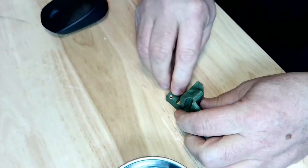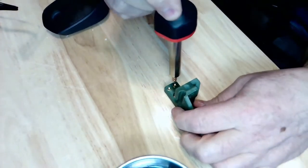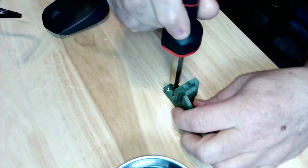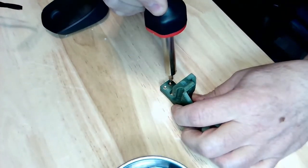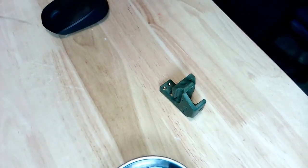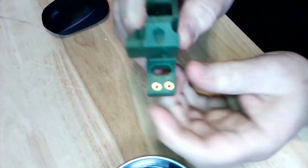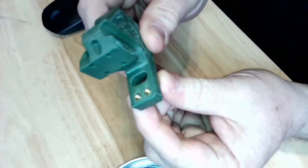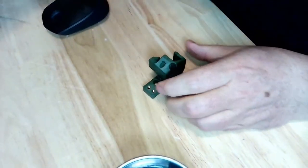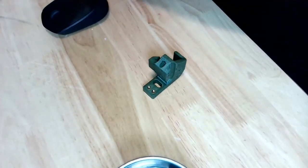Mind you, the iron gets hot. There's no temperature control in this iron. So let's try the second one. Oops, come on. A little more. Oh, there we go. It's a little below flush, but I think it'll work. Just a tad below flush, but I think it'll do the job. Very cool. And that's it. So I got to unplug this now. Okay, that's my first time doing heat insets. Cool.